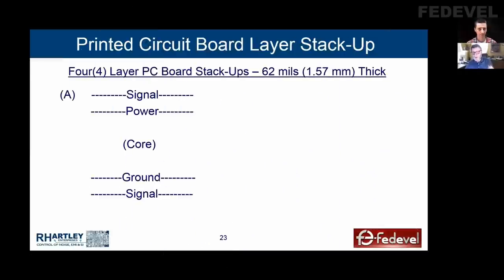This is a typical four-layer board. In 1995, I was still in the aerospace industry before I went to the telecom world. We had an EMI problem with a board just like this. It was in a product that was really inexpensive — it had to be a low layer count board, and it was the only circuit board in the product. So when we had an EMI problem, we pretty well knew what was causing it. We believed at the time that part of the problem was that all of our signals were routed on outer layers, and we were having fields escaping. We later realized we were wrong, but that's what we believed.